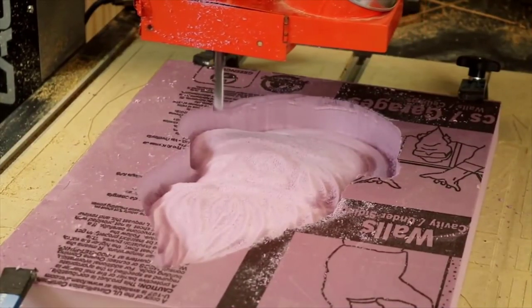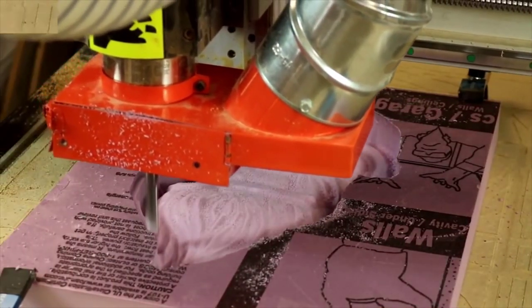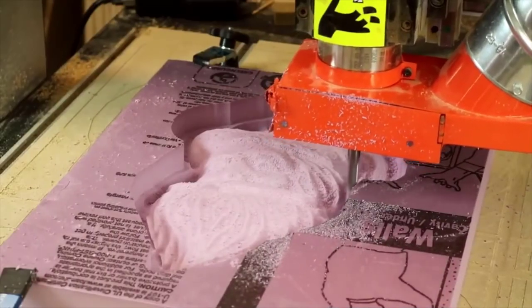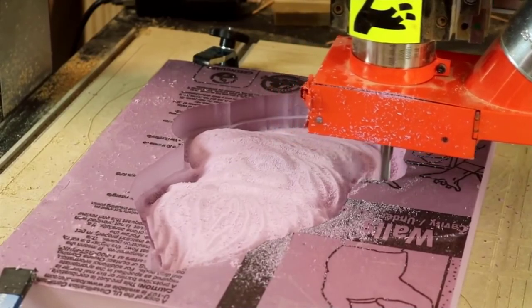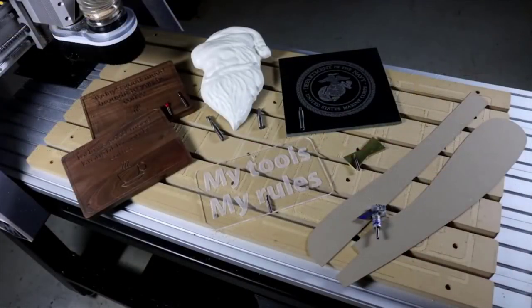The final outside shape is cut with a half-inch end mill — the same bit used for the roughing pass. Tabs are left behind to bridge the work piece to the frame. A little bit of latex paint and we're good to go. Like driving a car, speed limits aren't just a suggestion — when you're running your CNC router you've got to pay attention to feeds and speeds to get everything to come out right.